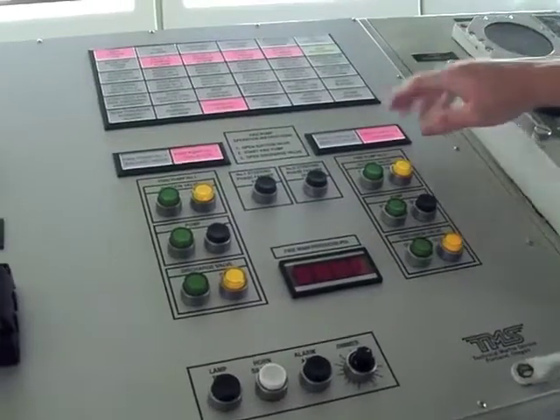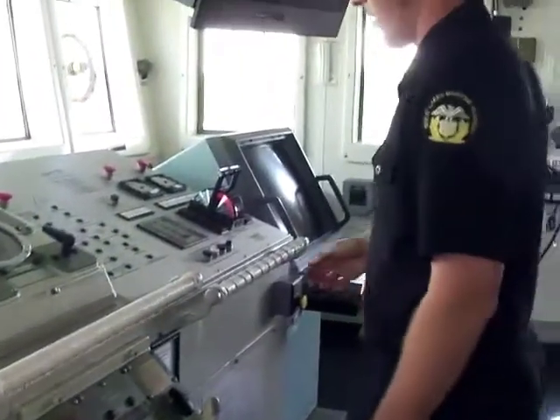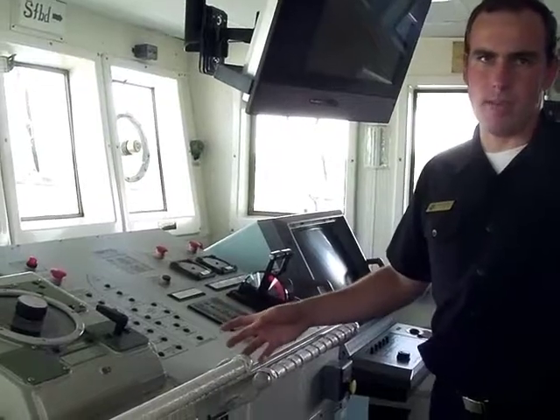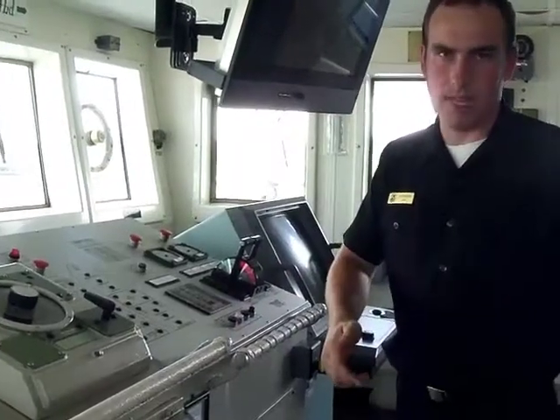Alarm panel — alarm just means it's not on, which is not supposed to be on right now. These lights indicate if the ballast tanks are getting too full of ballast, which is a problem. We sound them every two days, dropping a plumb down there to see how much ballast is in there. The ones that are supposed to be dry are dry, and the ones that aren't are at the correct level.